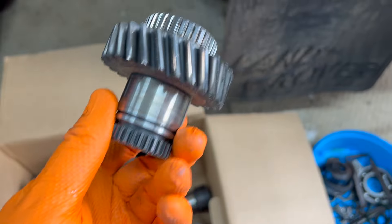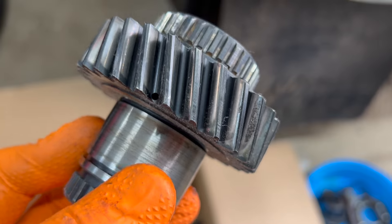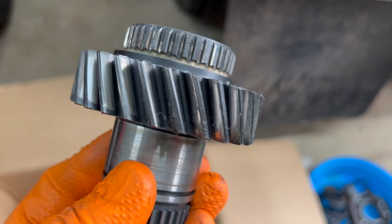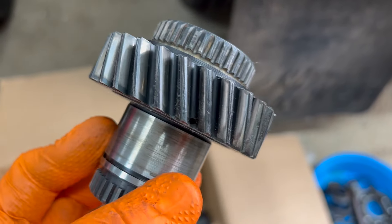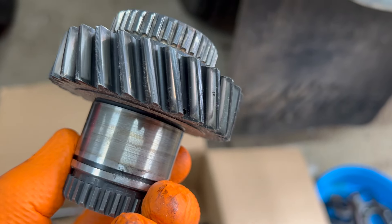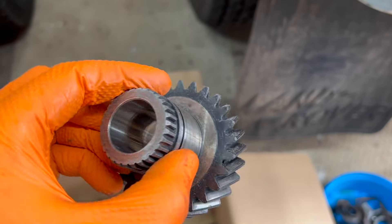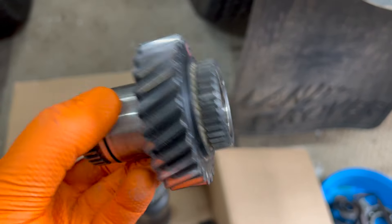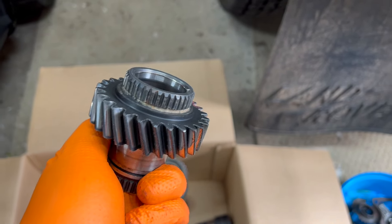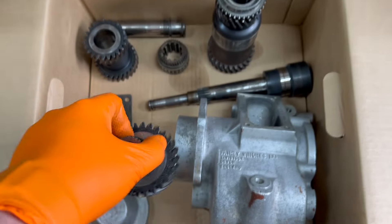This is the big gear at the back. The teeth aren't too bad — but looking at the steel of that, yeah, might look to try and replace it. One bad tooth — and if there's one there'd likely be more than one. Looking around there's a bit of damage on that one and a bit on that one. So that could be better if I can find another one for not too much money. But again, it's all about availability and economy.